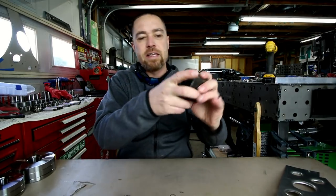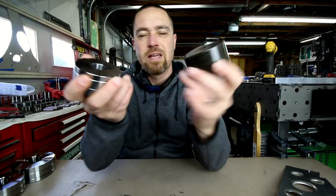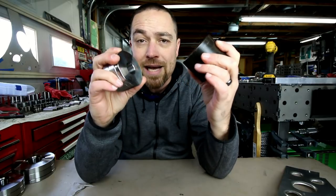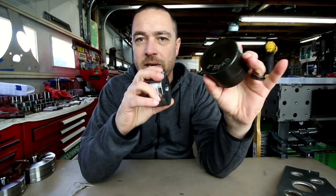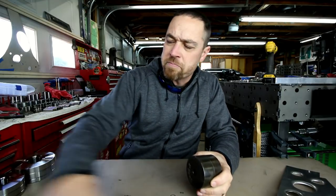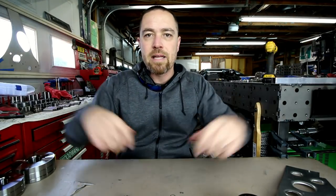The thing that's really rad about these and these is that with just a couple sets of these things, you can make some really nice custom stuff, right? You can put a bead in something, you can put a flare in something if it's sheet metal, you can put a dimple die in if it's plate steel, if you're making some kind of suspension components or some braces. You see them a lot in the drifting world where they're putting the dimple dies in sections that tie the cage into the body. You can do that kind of stuff. It's easy to get carried away as well, but done tastefully, it really makes a big difference in what your project is gonna look like in the end.